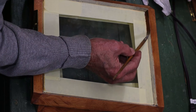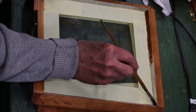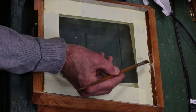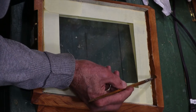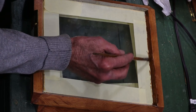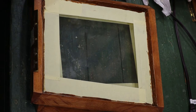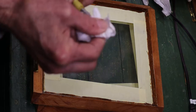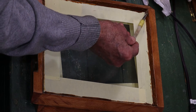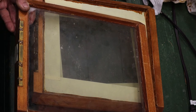Now we're going to start with some glazing. This is just a little raw umber, a little burnt umber, and some glazing medium. I'm going to brush it on, and then dry-brush it — just trying to put a little bit of wood grain in it. Get the spillover wiped up first. Here's my dry brush — that's not the one I used to put the material on. And there's the original versus what I've done.